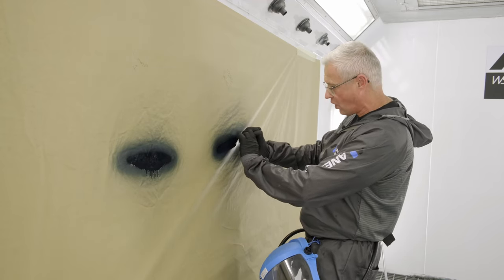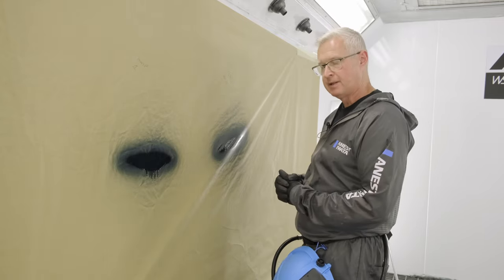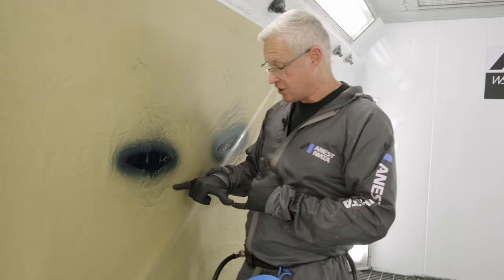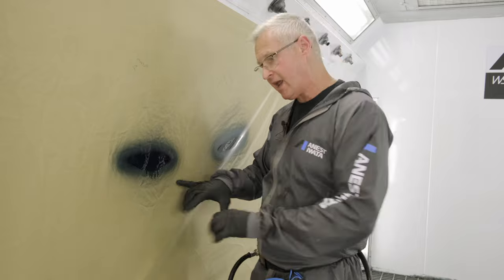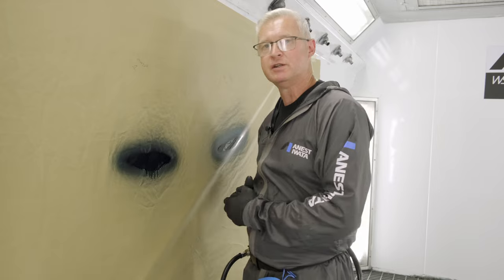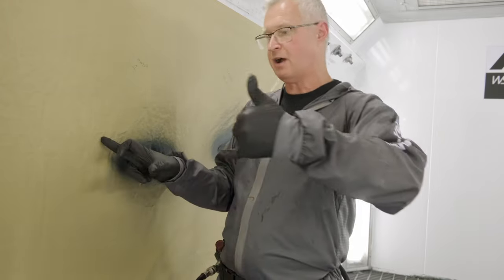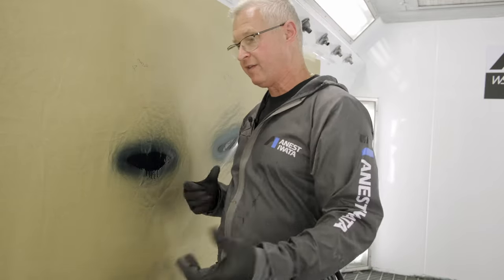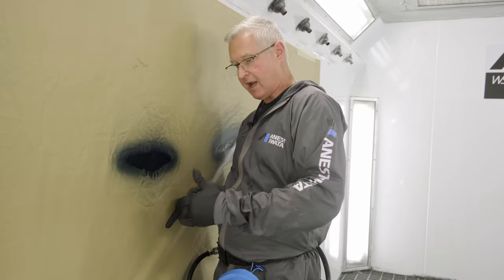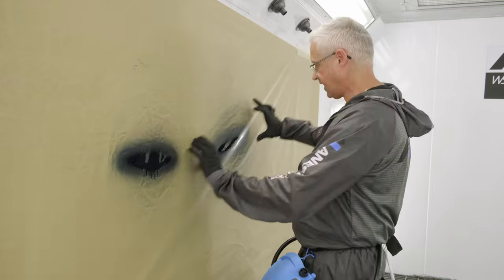No running is happening across the Series 2 pattern — it's nice and wet but evenly wet all the way across. The test distance was 150mm on both. When doing your pattern test it's an impact test — you get to your natural spraying distance, spray to fill the fan pattern, then back off. That gives you the definition of the pattern. Don't do a fluffy mess far away; an impact test fills it with material then backs off to show the definition.